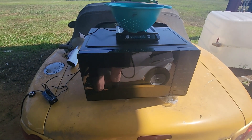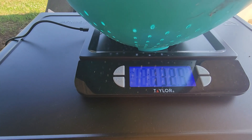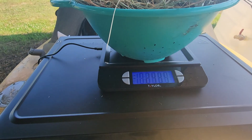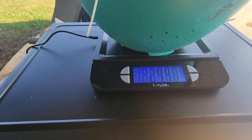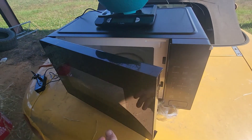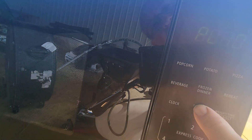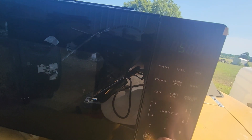Let's prepare our sample. First, we weigh our empty container — it's 132.5 grams — so we know the net weight. Here's my hay sample; we want something around 230 grams total. With the wind blowing, it's bouncing around a bit, but we'll call it 243 grams total. So we're ready to put our sample in the oven. We're going at power level 5 for 5 minutes. Start.